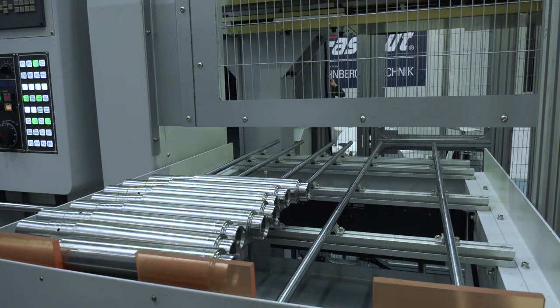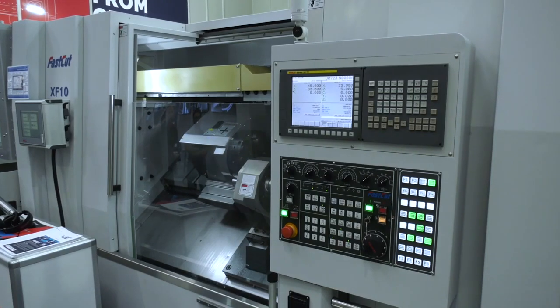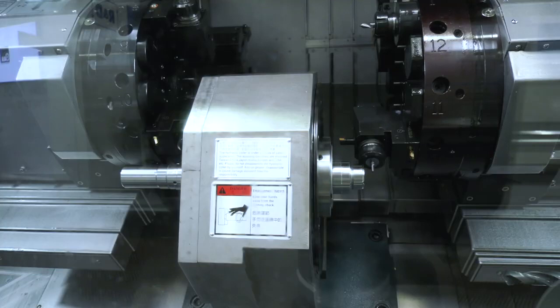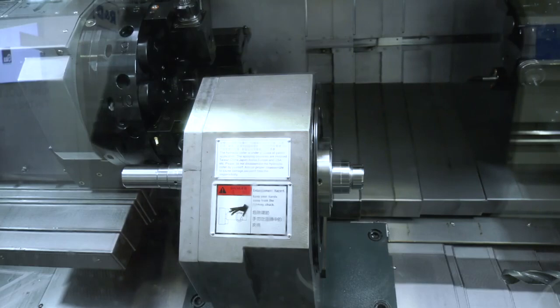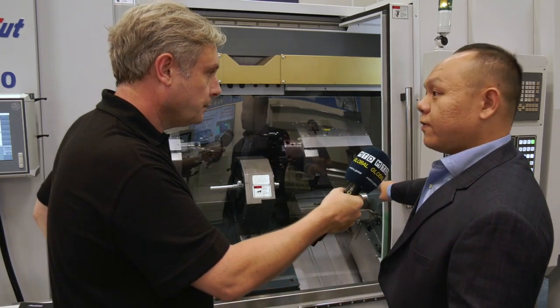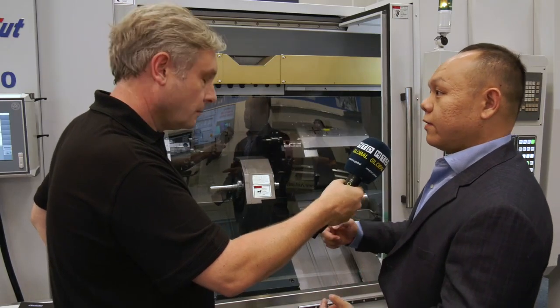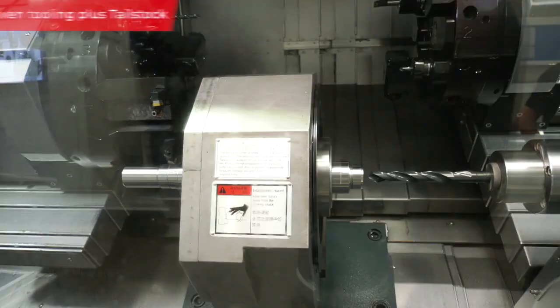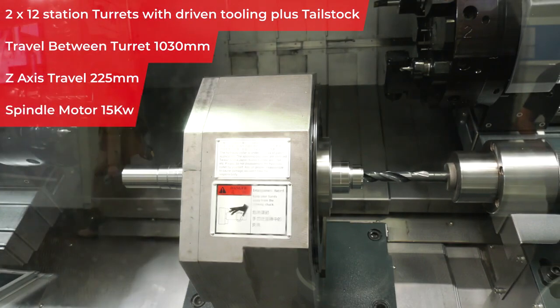We also have a loader to load and unload in the same direction when there's a large shoulder on the diameter. Within the working envelope, this is a solution for hollow shafts. The bar comes as a co-forged solid bar, and customers often need deep hole drilling. We modified our servo tailstock into a drilling unit so you can drill through the shaft, and during drilling we do parallel cutting from the turret to save cycle time — essentially balanced turning.